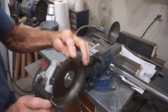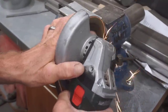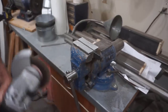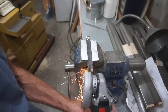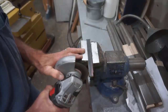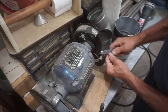Using an angle grinder with an eighth inch cutoff wheel, I chase through the saw groove to even up the bottom of the groove to a consistent depth, widen it a bit, and ease sharp edges so the QD clip engages smoothly in use. Using the same disc, I grind away about one eighth inch off each edge of both ends to reduce the clip bar width to the one half inch spacing of the QD clips, then ease all the ground edges. A quick once-over on a wire wheel smooths off roughness left by the grinding process.